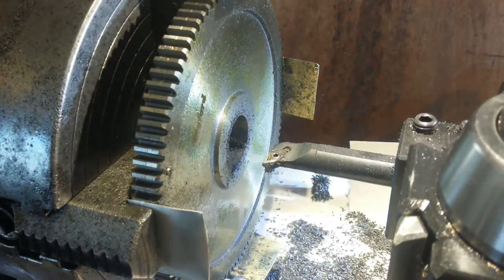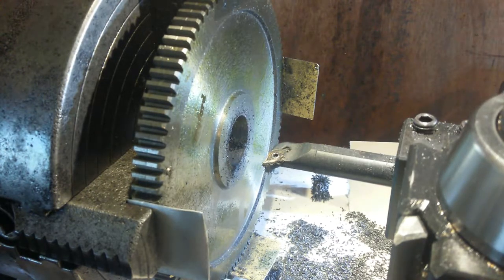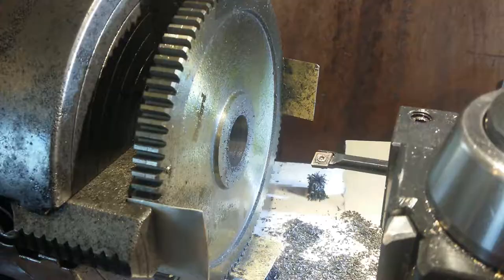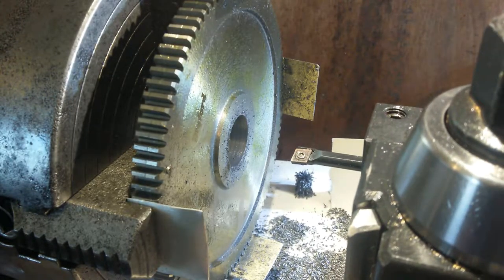When it kicked out at the end, it had all that tool pressure from putting a 50 on. Well, I actually took it down to 41 thou because I suddenly realised it's 50 thou per side, and if I take 50 thou per side off and it overcuts, that will definitely be too big. So that should be now exactly 20 thou shy of what I need. Oh man, I'm going to hit the camera. I have to get a different angle, just pause for a second.